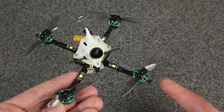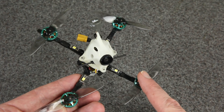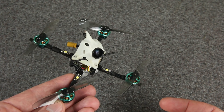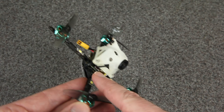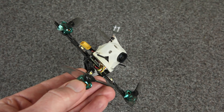If I stayed on 1S, I'd be drawing a lot more current and getting a lot more voltage sag. This one on 2S actually has more punch — even with the HD camera, it has more punch than my 1S builds, especially climbing on high throttle. The second reason is the Vista air unit; according to the specs it needs at least a 2S input voltage, so I am powering this one directly from VBAT.